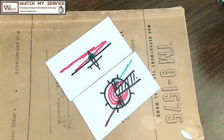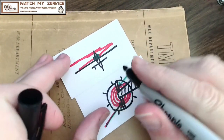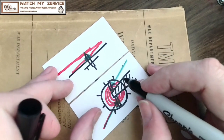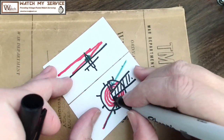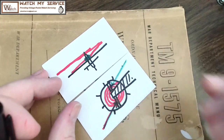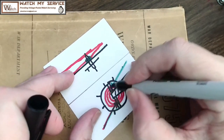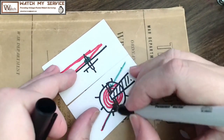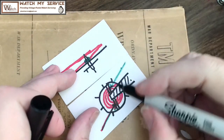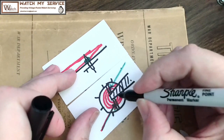I've had watches that I've repaired and I've looked at the balance sideways, very closely, and I saw it was just barely touching. And what you had to do is go right at the collet. It's usually not caused by the studding on the other side, although it can be. I'll explain that one in a second. But if it's at the collet here, then the whole thing is riding at an angle, like 5 degrees, and it's touching the arm, then you actually have to fix that problem at the collet, right? And you can do that.